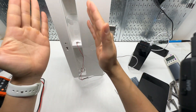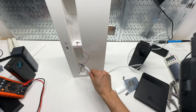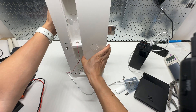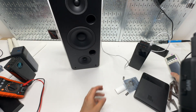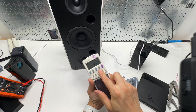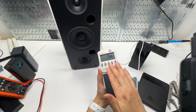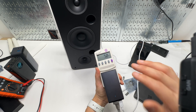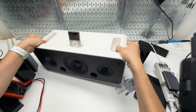I'm pretty happy with the build. I can't wait to use my drill press to create a few holes and fit this thing inside to use it around the house with chargers. You can also use power delivery chargers directly. The power consumption at startup is around 14W as it checks for power, then it goes down to 7.5W. It's not 100% efficient, so it's actually consuming about 5W.